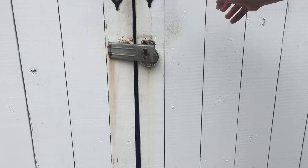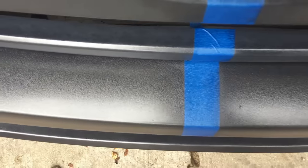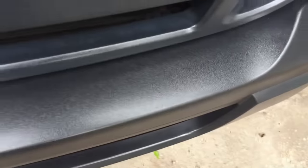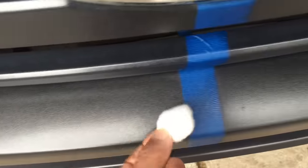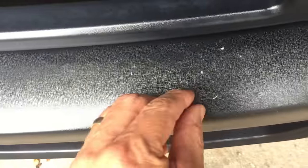It's the next day, about 20 hours since that second coat. The linseed oil side once again is nice and even. And the penetrol side — remember there was a dry spot right here — that's gone. And the spot we saw there is also gone, so penetrol looks nice and even, and both sides match very well. To prove that it's dry, I have a cotton ball that I'm going to drag across both sides — if it was not dry the cotton ball would be sticking. And actually that linseed oil side is a little bit wet still, as opposed to the penetrol side, which is completely dry. The linseed oil is still a little bit tacky. Now that cotton is stuck in there, so that's a point in favor of the penetrol — it seems to dry faster.